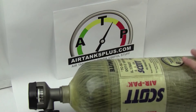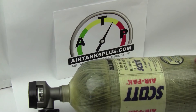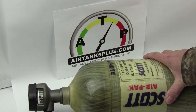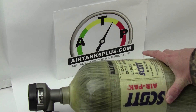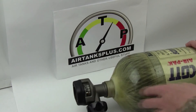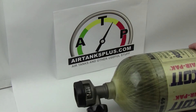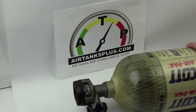Once they check it for any signs of damage, the next thing they're going to look for is they're going to check and see if there's any air in the tank. Typically these tanks do not come in empty — they usually have air left in them. So whenever they see a tank that's empty it causes a big red flag. We as air gunners like these SCBA tanks because we can easily see how much pressure is remaining in the tank here. This one has about 3,800 psi in it. Typically you'll bring it in with around 2,500 to 2,800 psi — that's about the time you'd bring your tank in to get it filled.